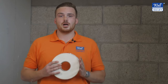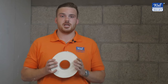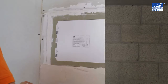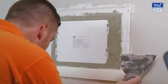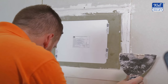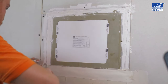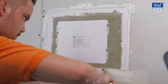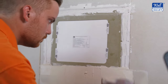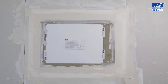Apply drywall compound and paper tape using high quality pre-mixed drywall compound. Paper tape will perform better than mesh or fiber tape. Apply the paper tape to the bottom of the wall mount front groove. Align the paper tape so no part of it will touch the inner groove slope and squeeze out all of the drywall compound beneath the tape. If required, cut along the paper tape to reduce its width. Let the installation thoroughly dry at least one day, or more if you are working in a damp room.